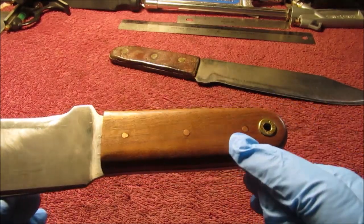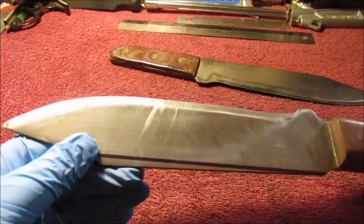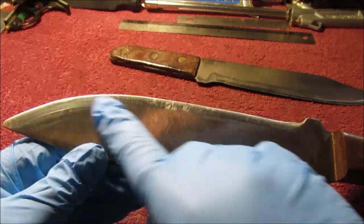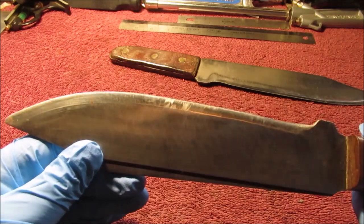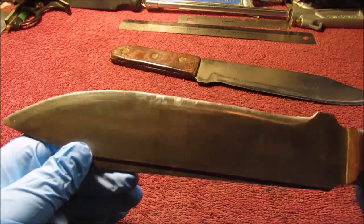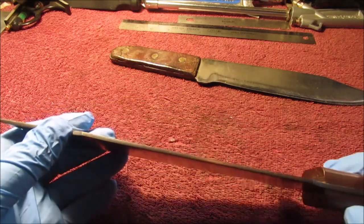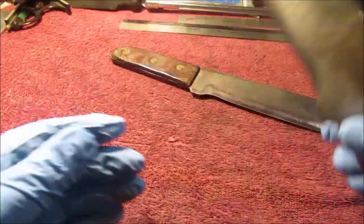That's just probably some brass welding rod. This was sort of heat treated. I'd heated this with the torch to get it orange red hot, quenched it in water. Then the next time I heated it, I got it kind of into a bluish tinge and put it down into a bucket of stove ashes. So it's not properly made. I just made it to chop wood with. It is a little bit thicker than this metal, but it's nothing special.